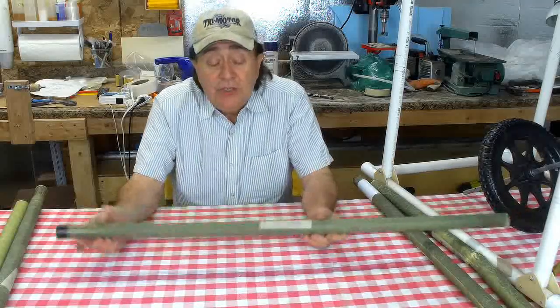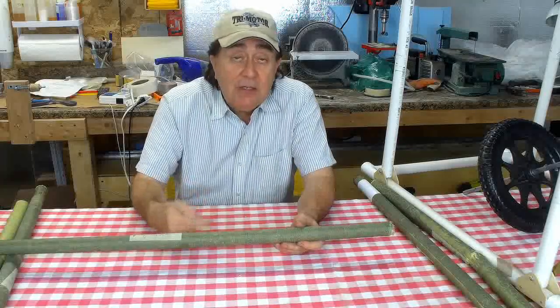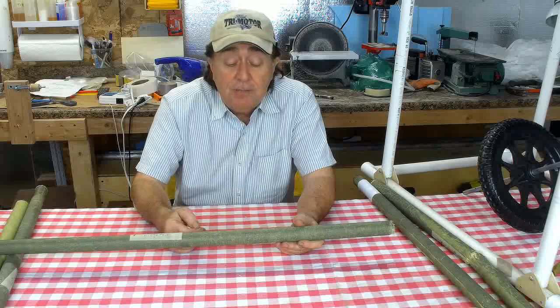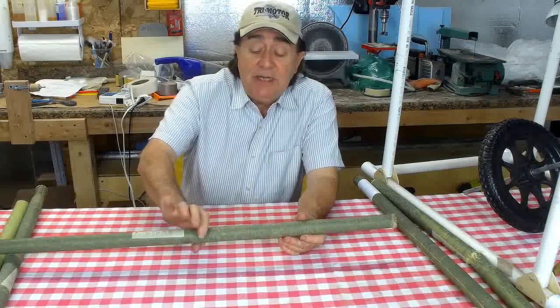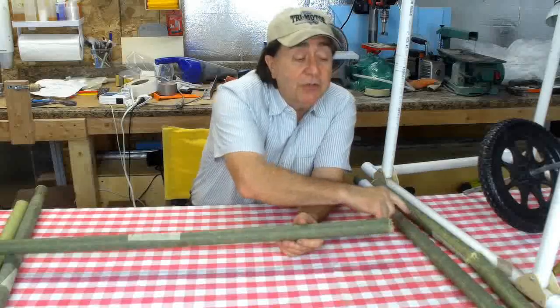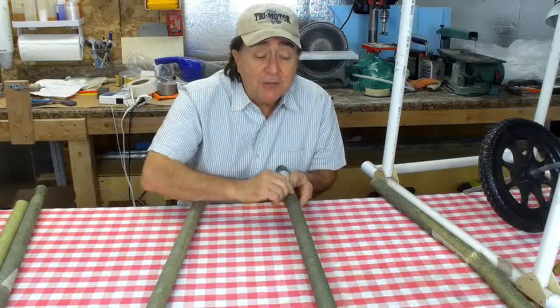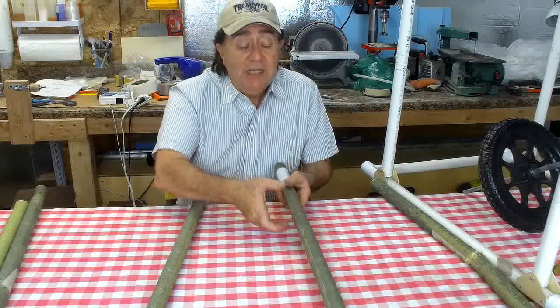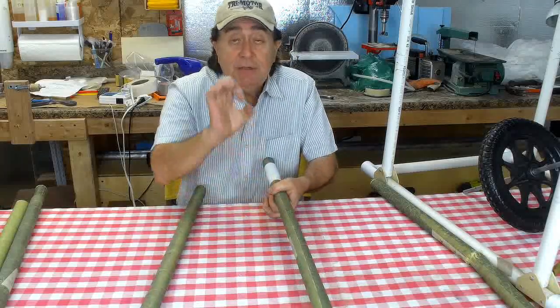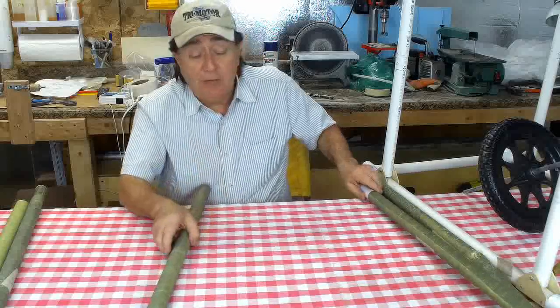Now, the reason that I did it that way is because if you're not interleaving the Kevlar, you need something to take the hoop stress loads. The Kevlar normally does that. This is all unidirectional. This is optimized for bending stiffness. All of the high strength materials are running lengthwise, and the hoop loads that keep the tubing round are carried by the Kevlar, which it's very good at, by the way.